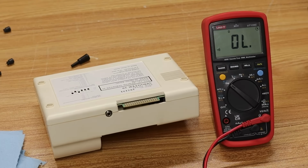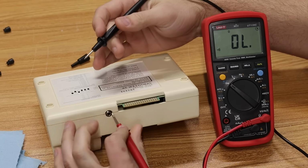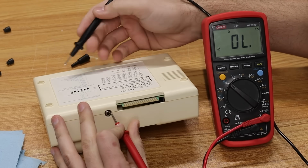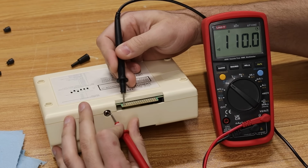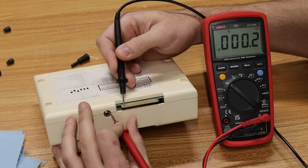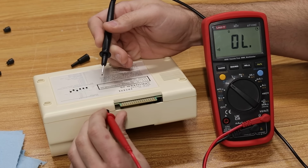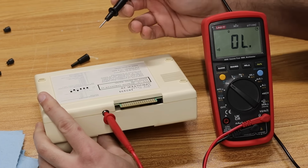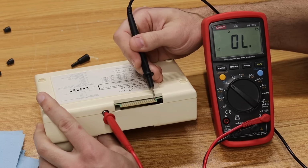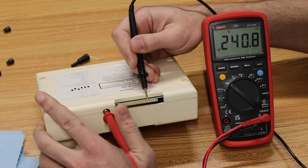And after I cut the camera in that last shot, I realized that the easy way to figure this out is just with the multimeter here against the edge connector. So the outside of this ring should be ground, and looks like ground is pin 1 on the right side, which should be this guy here. And yep, looks like we got a direct connection to that. So then if I stab this probe on the inside, that's going to be making connection with the center part of it. And plus 12 is on pin 13. So it's going to be 17, 16, 15, 14, 13 right there.